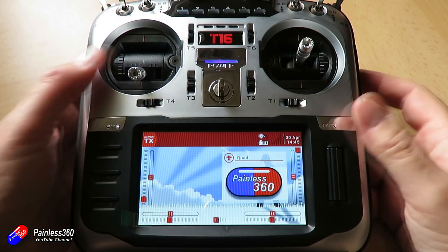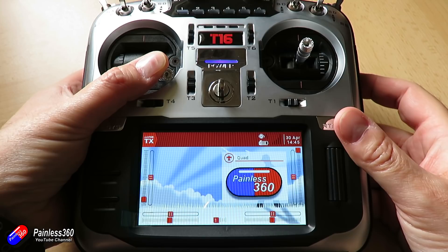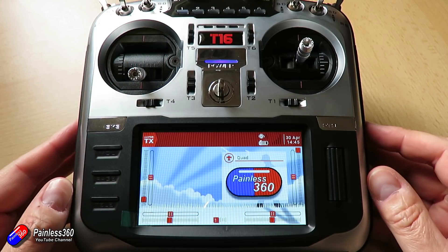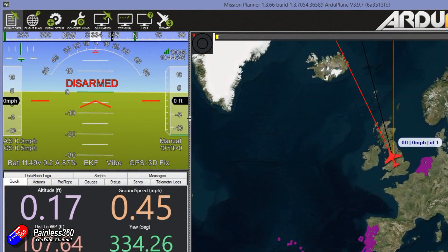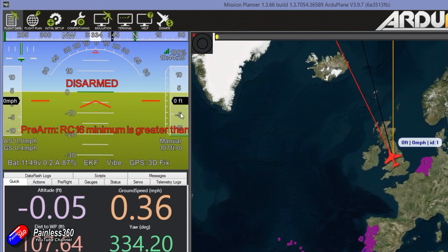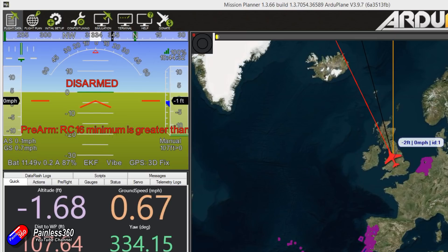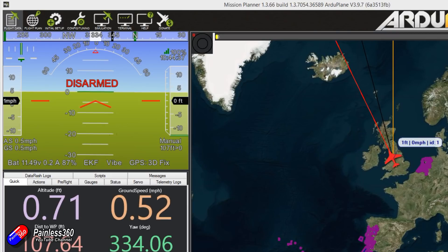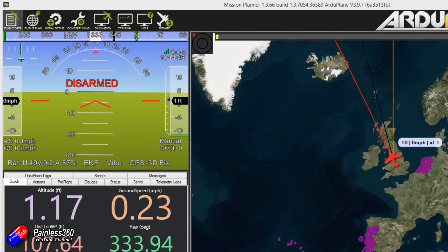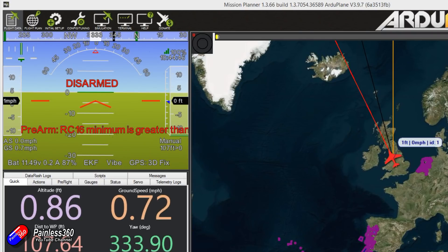Now to talk about the last stuff. Getting this thing to arm probably gave me a good couple of hours of fun. To arm an ArduPilot flight controller you hold the throttle at the low position and the rudder to the right for about three seconds, and that should arm it. Make sure it's powered, plug it into Mission Planner, and have the basic screen with the artificial horizon visible because it will tell you exactly why it won't arm. I was getting lots of different errors, which is entirely normal - let me go through them so you don't catch the same ones.